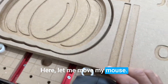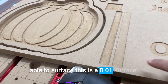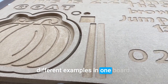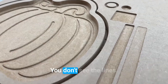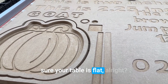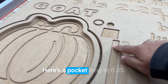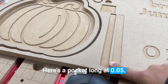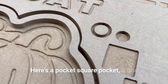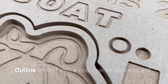With the quarter inch end mill I was also able to surface — this is a 0.01-inch surface pass. I just wanted to make as many different examples on one board as possible. Look at that — you don't see the lines, but you definitely have to make sure your table is flat. Make sure you surface your tabletop. Here's a pocket long at 0.05, here's a square pocket, a one-inch circle, and a one-inch circle outline — all done with a quarter inch end mill.